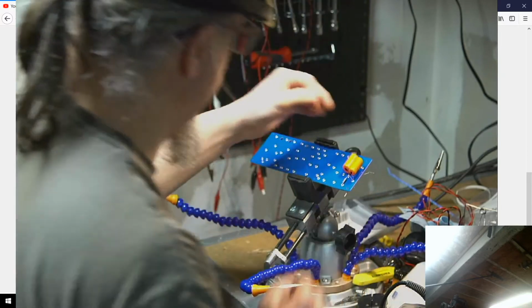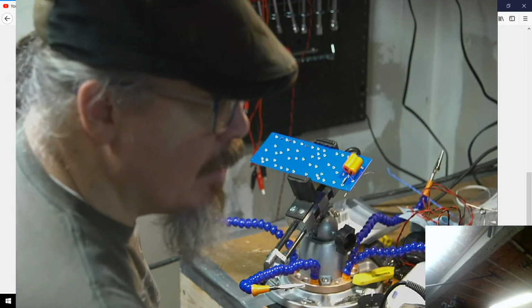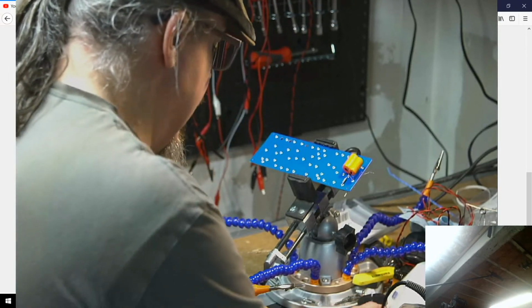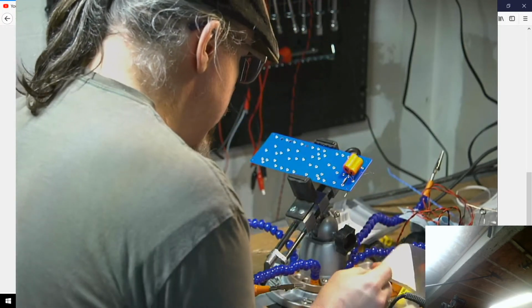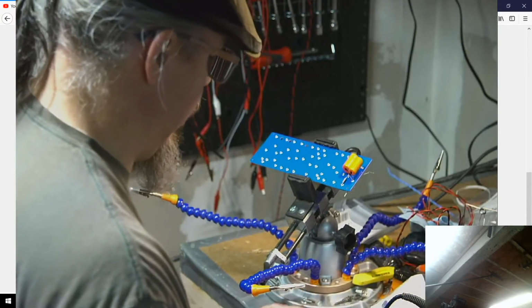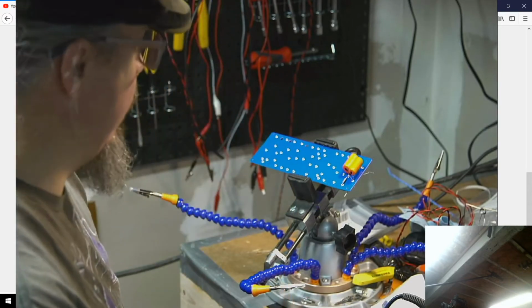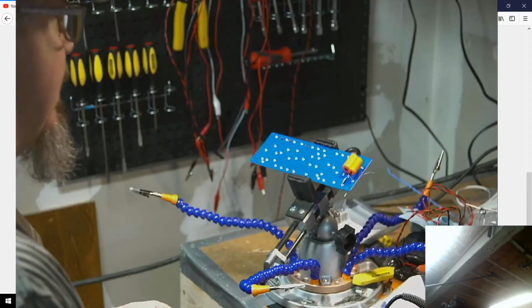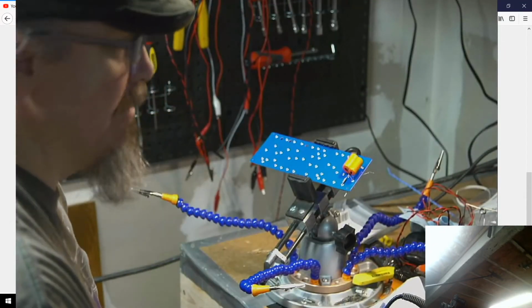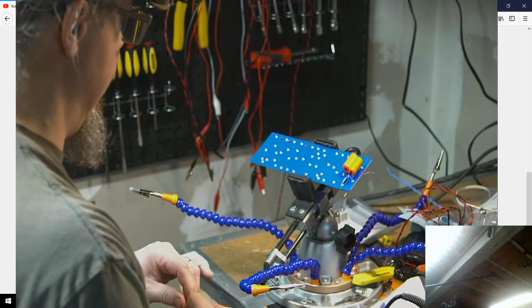Okay, next up is this one that goes to here, a 0.3. Oh, this is something I found out I'd kind of gotten askew. I ordered a 300 picofarad capacitor for this, and I've also marked the end of that one. But I couldn't find a 330 anywhere to save my life, and that's what it says here. So while you're off a little bit on the capacitance for this, it's probably like the treble. If I feel like my tone shaping is out of what I would prefer, then I will definitely go through some part of this process and adjust that. So, but meanwhile, for now, I think we're going to be okay.